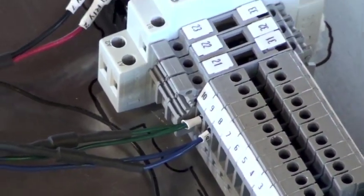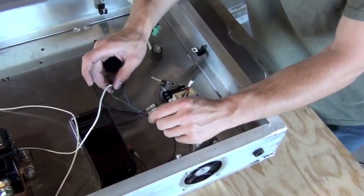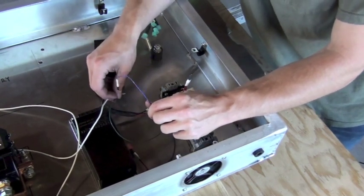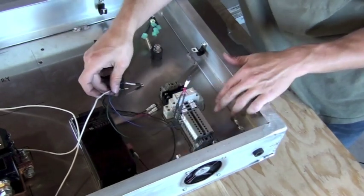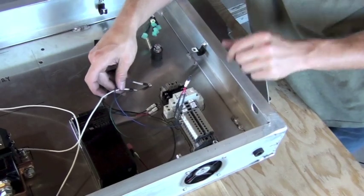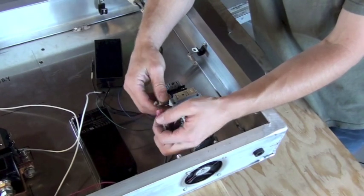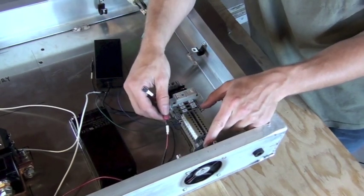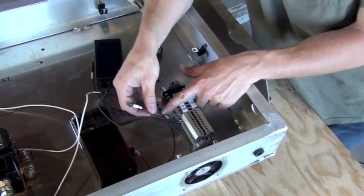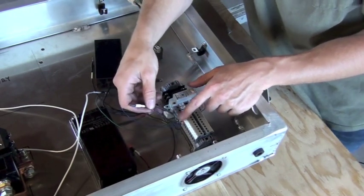Connections 9 and 10 are now made. The green wire gets power when the car is turned on and the blue wire gets power when the charger is turned on. On the other side, these connect to the DIN rail points where the dashboard lights come on — the green and blue lights indicating power to each system. The other plug goes to the fans so that when the charger or vehicle is on, the fans are on. These also have a diode built in to prevent power backflow into the system.